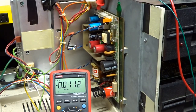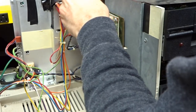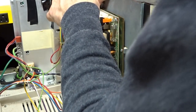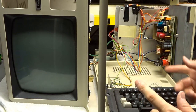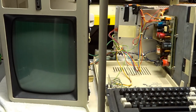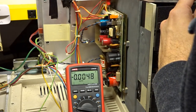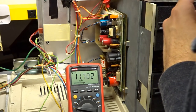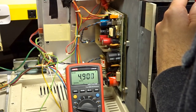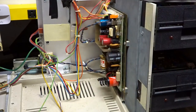Alright, I'm going to plug stuff in and see what happens — I don't see high voltages coming out. Connected the big molex. We've got filament on the CRT and it's a floppy drive. Let's check these voltages now that there's load. There's the raster showing up. The computer's on and seems to be working. We've got negative 12 on that rail, 11.7 on the 12-volt rail, and 4.9 on the 5-volt rail. Looking good — all the rails are up and running.